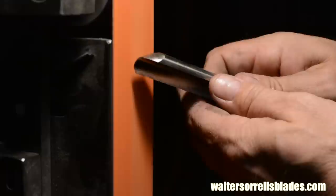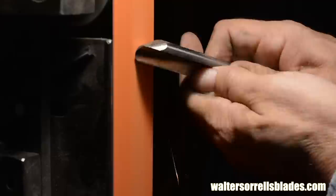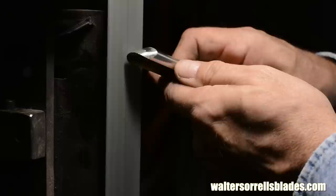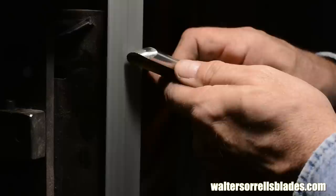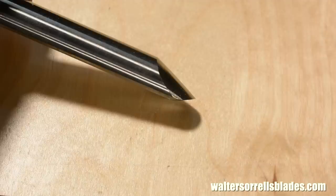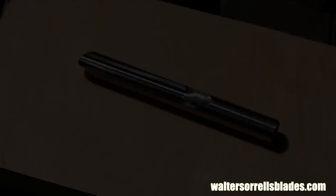Now I'll grind the relief angle of the cutting tool. If you're an experienced woodturner, you may have a Sorby grinding tool or some kind of cool grinding jig — if you do, by all means use it now and set whatever angle you're aiming for. I'm just going to freehand it; I'll just try to eyeball a consistent angle. I'll set the angle using a 40 grit ceramic belt, then hopscotch up the grit levels: 60, 120, 220, ending up eventually with a 3M 30 micron plastic belt, which gives me a nice sharp edge. One thing I want to mention: I was really winging it as I was doing this initial grind — it's actually too steep and I had to go back and change the tool later on. You'll want to get closer to about a 30 degree edge; I was probably at about 40 here, and that was really too steep. You'll find various recommendations about what angle to grind, but in theory the harder the material you'll be working, the steeper the grind. And that's that — the cutting tool is done.